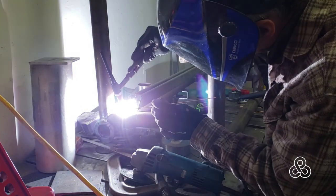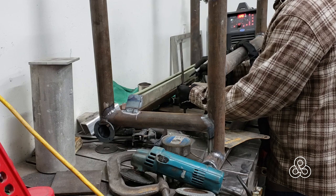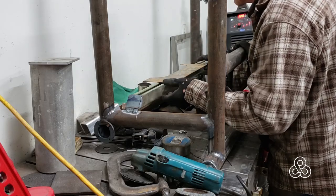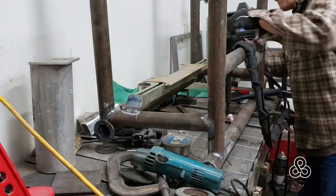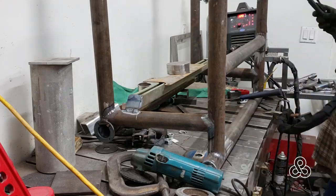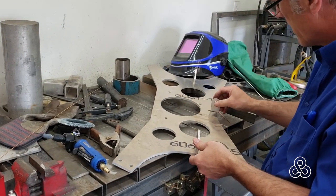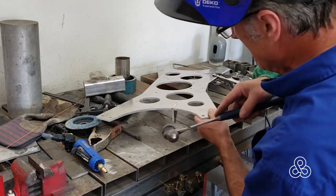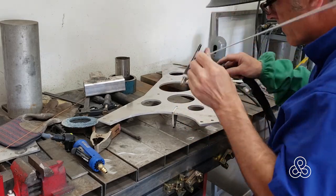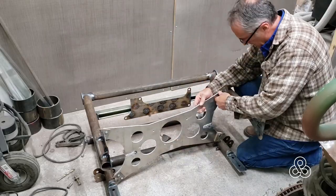Here's the problem that we had mentioned in our title — this is the bracket put on to hold our steering rack. Welded it in place with all the trouble of measuring, making sure the thing is nicely set. But my miscalculation was some clearance problems. I had this plate, water-jet cut to match my steering rack out of a Toyota Prius. The differential is going to sit in this bracket made out of aluminum — because it's a pretty wide expanse, figured I'd save some weight. And I've got these little tabs that are water-jet cut and notched in there nicely, so I weld those in place.